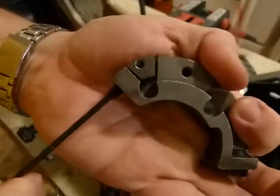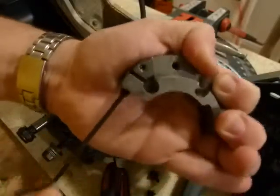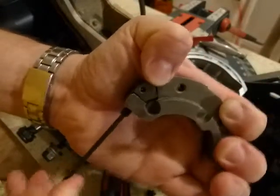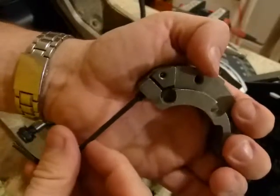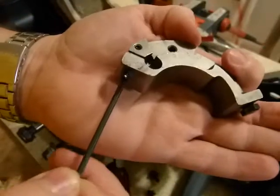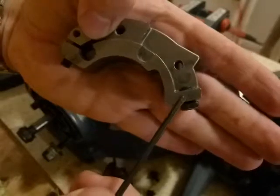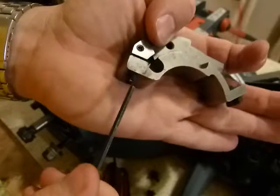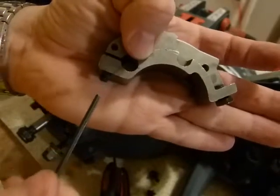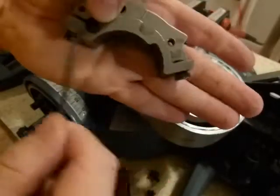I'm going to rotate it now so you can see how as it advances this gap increases, and as I retract it in the opposite direction this little block will follow and stay tight against the end of the screw. It's important to note that this adjustment screw is metric with a pitch of one millimeter — it's an M6x1 screw — and this one has a thread of M8x1.25. Consequently, because their sizes and pitches are different, one full turn on the first advances or retracts one millimeter, while one full turn on the second is 1.25 millimeters. So they don't correspond in a one-to-one ratio.